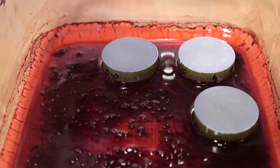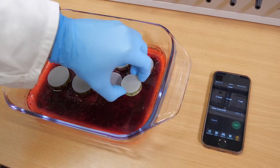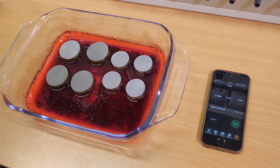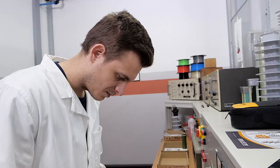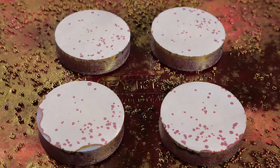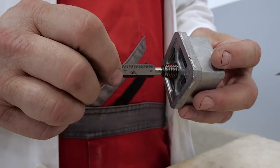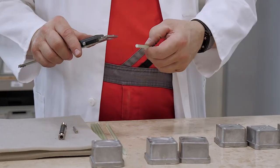Electrical corrosion-resistant epoxy rods in the core of the Surge Arrestors are tested for moisture penetration according to the specified dye penetration test. If the dye penetrates the top layer of the samples within 15 minutes, we reject the whole shipment. The rest of the components are checked using the sample method with calibrated measuring tools.